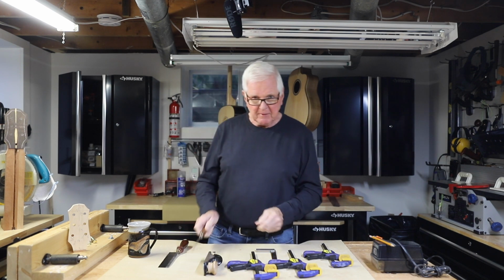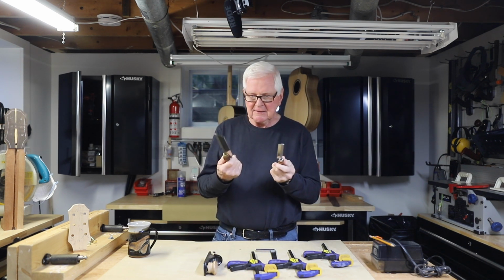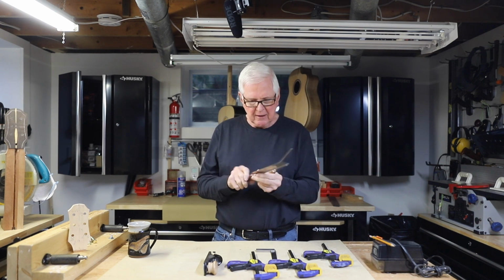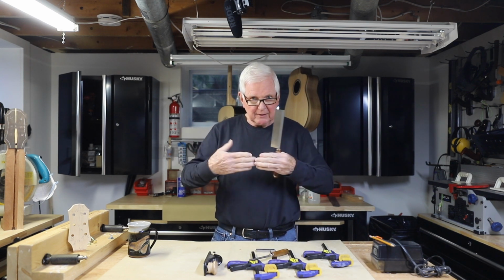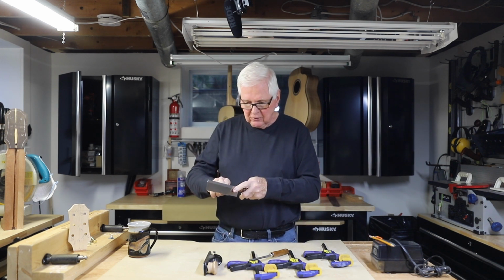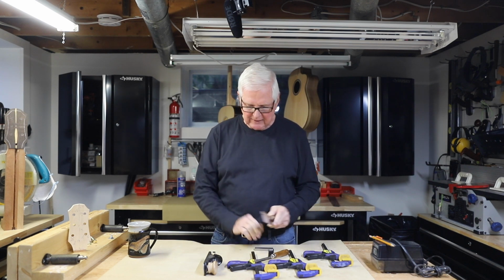Now, I just mentioned the fret slots. These are 2 small saws. I got these at, I believe it was Lee Valley, and no, they're not sponsors. This is a little thicker. Sometimes when you're cutting and squaring off the back of the guitar to bring it together, then you'll use this, and you'll use it as a guide, and you'll just run your saw back and forth like that.